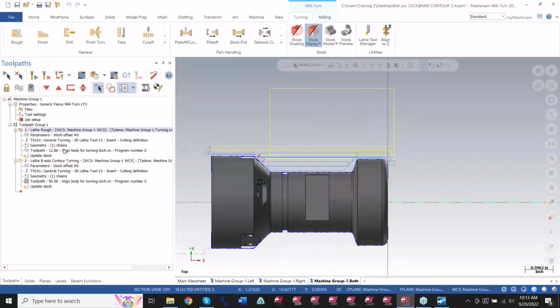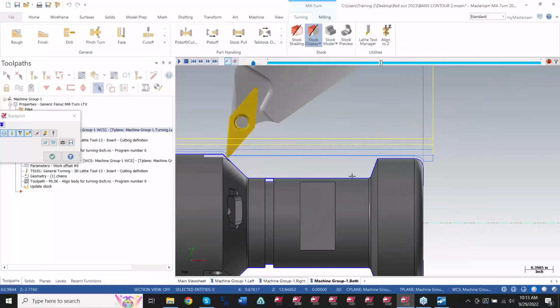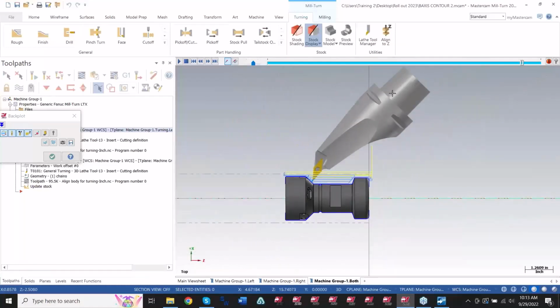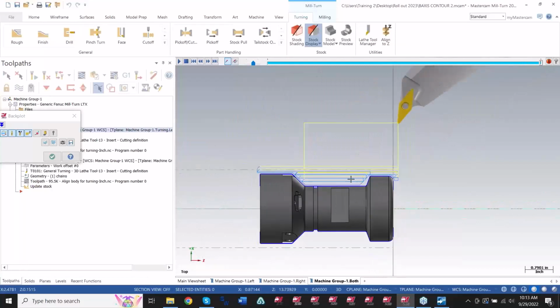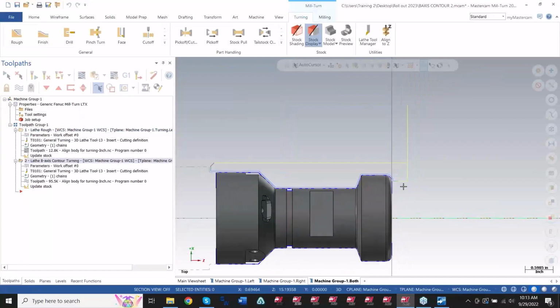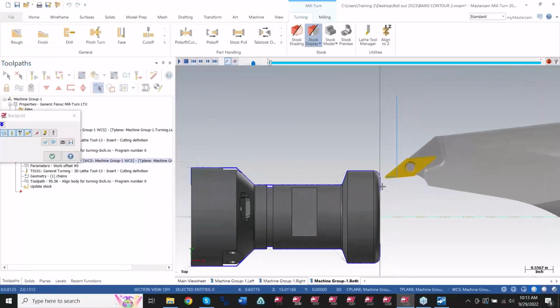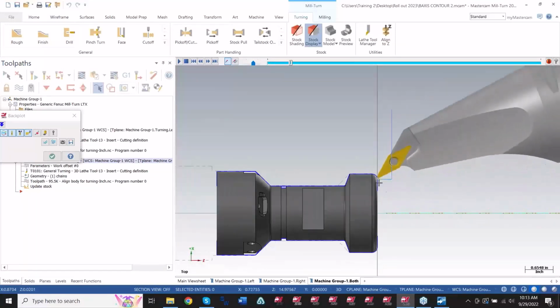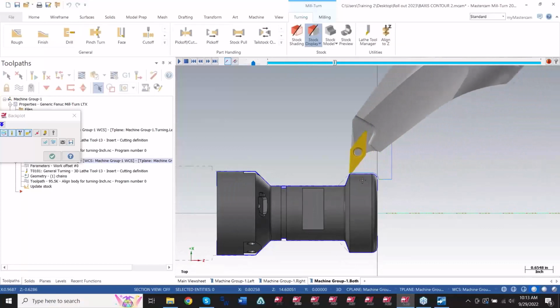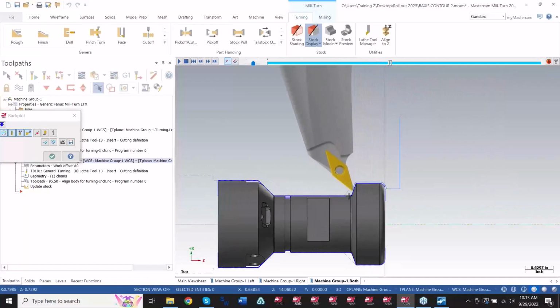So back in the day, to achieve this cutting motion, I would need to make sure I got a tool that can fit in this angle from all sides. And I can change the angle from toolpath to toolpath and go from there. Well, now, if I want to finish this in one toolpath, I can use this B-axis contour. What this does is it'll align based off of either an automatic motion or a set of tilt lines to cut in the motion you need. So here now I'm cutting in the correct spot of the lip going downward.